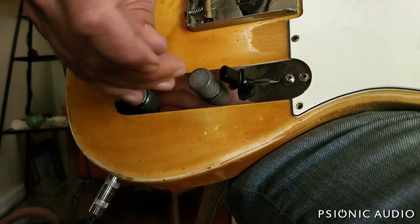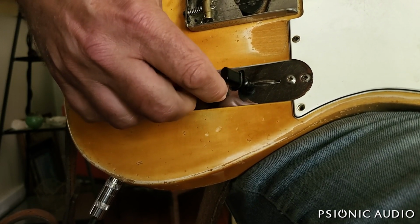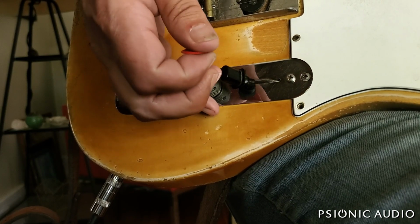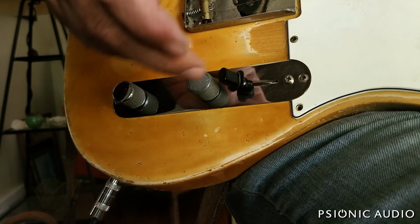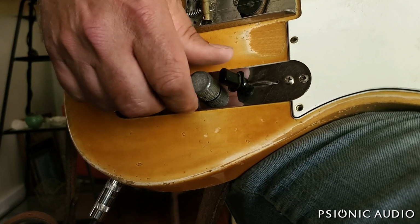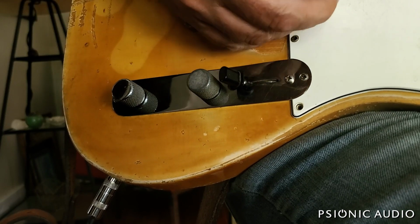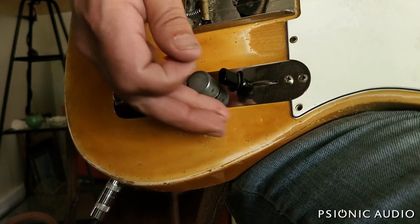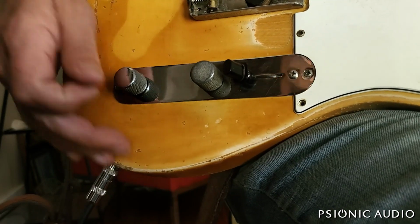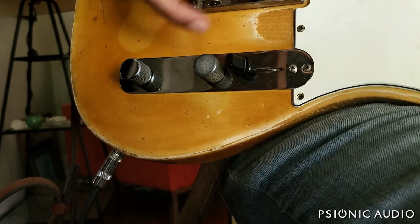Linear can be better because you have a lot more subtle variations, even though you don't have the real good use of the low volume stuff, because the linear goes from nothing to loud pretty quick. It's like going from here instantly, and there's just nothing in between. So that's why I went with the 30% J taper, vintage taper on the volume.